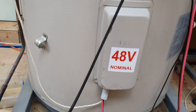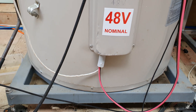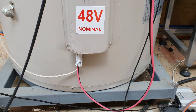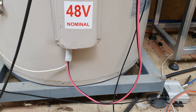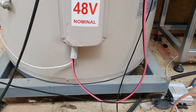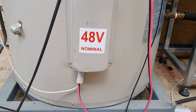I use the original thermostat. I've got a cover underneath at the moment — it's a bit of a mess — but the little white wire is actually hooked up to the thermostat inside, and the red and black cable is the actual 48-volt, or nominal 48 volts, from the battery bank that actually feeds the element inside.